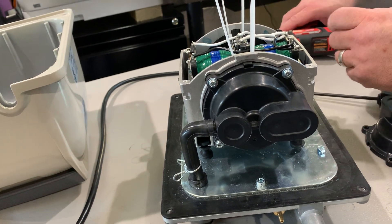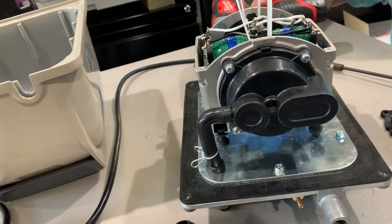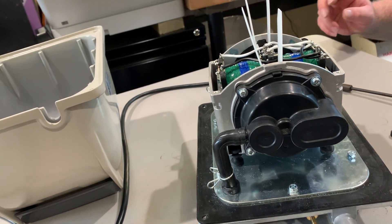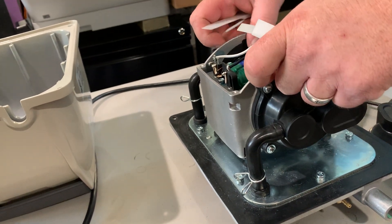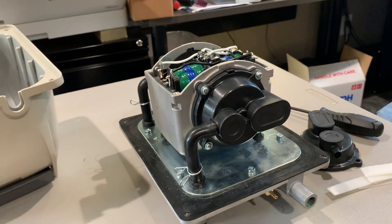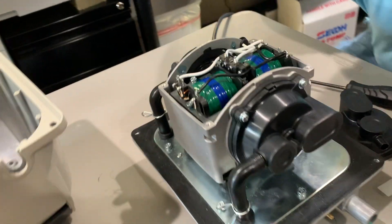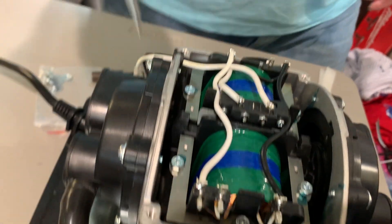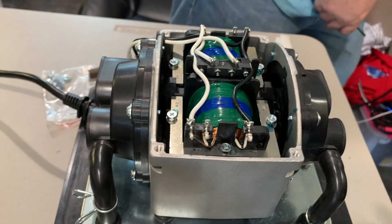Two more and we're good to go. The Seikos should get anywhere from four to five years out here in Texas. Texas is pretty brutal on aerators — it's hot year round and you just have more issues with the pumps. Everything's lined up, everything's good — good spacing, nothing's gonna move. I'm gonna plug this in. The pump's not working because the switch is engaged, so we're just gonna move this switch a little bit and push it in right here. It's pretty sensitive, so once it's centered it should turn on.